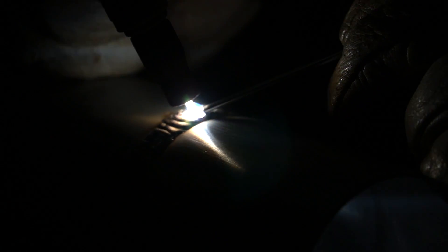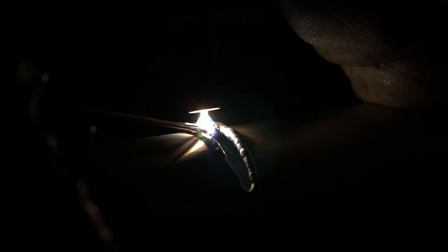Be honest with yourself — if you try to get too much filler rod in there it will solidify immediately and you'll lose your gas coverage as it builds up and falls apart. If you can't maintain with a larger diameter, switch to a smaller filler rod. I'm starting on one side, dabbing as I move, and when I reach the left I switch back to the right and move the same direction again. This lets it cool evenly and helps me maintain heat. Walking the cup back and forth until it finally fills in.